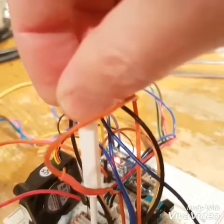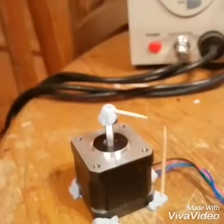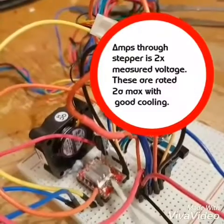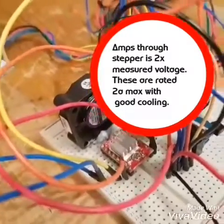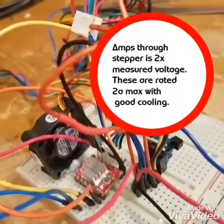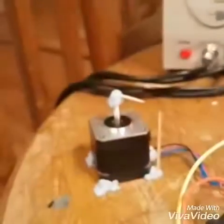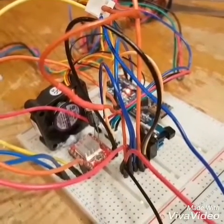I turn it down until it doesn't work — not enough voltage. Turn it up and now it's got enough. I didn't know this, but basically if you put your positive multimeter probe on the trim pot and negative on ground, whatever voltage you read, double that and that's the amps the board is drawing. It's only really rated for one amp continuous, or up to two amps with really good cooling. So if you're reading 0.6V, you're actually pushing 1.2 amps through that board — if you're not cooling it, that probably won't do it a lot of good. If you need to test a motor or a stepper, you can download a little bit of Arduino code, a few bits and pieces, and that's how you do it. I'll link his video in the description — cheers to that guy for doing that.